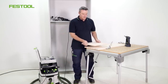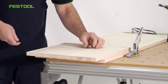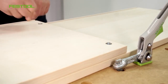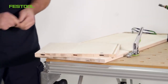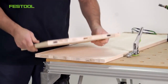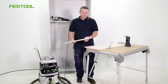We'll insert the individual parts into the workpieces. Firstly I'll insert the shelves, which are locked by a plastic clamp to prevent them from falling out. I've routed another hole here for a normal wooden dowel. There's also the option of gluing this dowel in. The shelf has now been prepared.